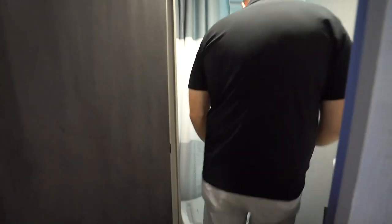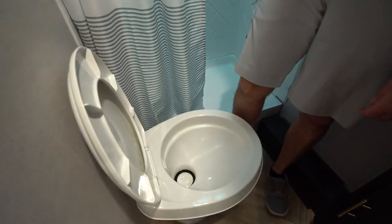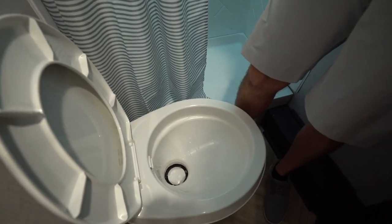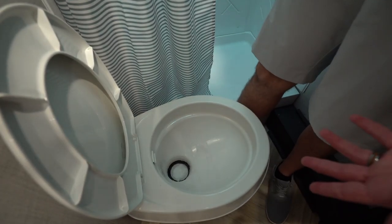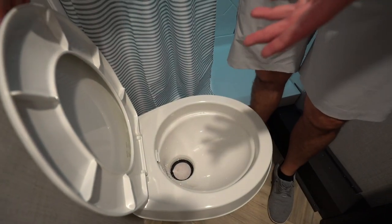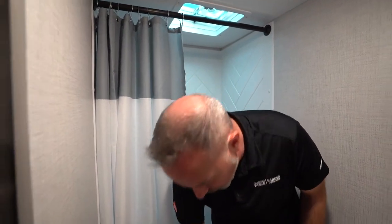Plastic bowl, high-rise with the foot flush on this one. If you just need to put some water in the bowl, you just push the pedal down just a little bit. To totally dump, you push and hold. Now, if you notice the bowl is constantly draining, chances are the black seal is a little worn out and the stopper isn't going all the way over it. You can take some Vaseline on a glove and just wipe around the bottom there — that should help it.